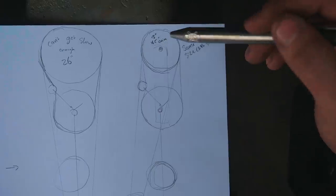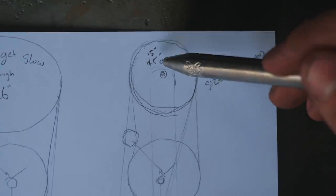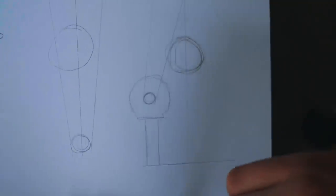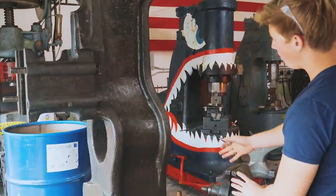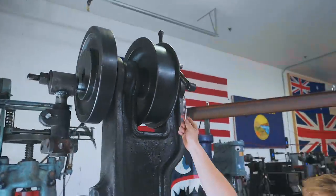So, what we're going to do, I found a 15-inch pulley at a friend of mine's place in Lewistown. I'm gonna get that pulley. I then have an 18.5-inch V-belt pulley that'll come down on a jack shaft to the motor sitting down here. So the motor will sit down here, drive up, the V-belt pulleys will sit behind the frame, it'll be a jack shaft up above that drives another big pulley that then has the slack belt around it.